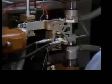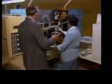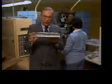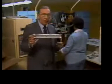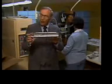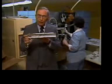We are now beginning tracking arm buildup. Now, the arm assembly is die-cast zinc. This precision boring device is making sure the assembly's fastening holes are exactly aligned. You see, the arm is a very complex device.